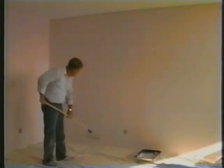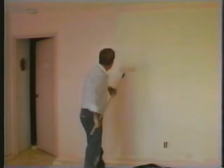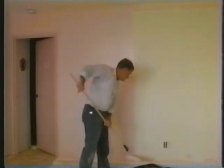The method then is to apply lots of paint to the wall, then immediately back roll over the area without additional paint to completely smooth out the paint. Many people try to overspread the paint, making the paint film too thin in places, resulting in a patchy, poor hiding paint job. The secret to avoiding this is to reload your roller frequently so you're not spreading out the paint too far. You're putting on the correct amount of paint if the paint film appears to be a consistent thickness and covers the old color evenly without dripping or sagging.